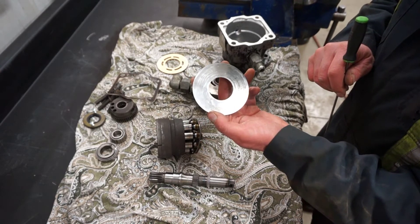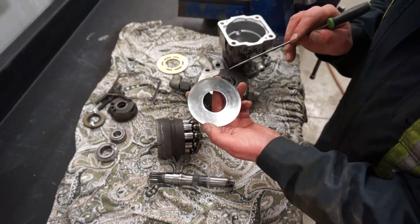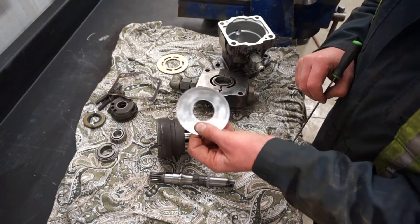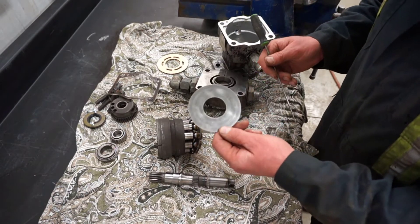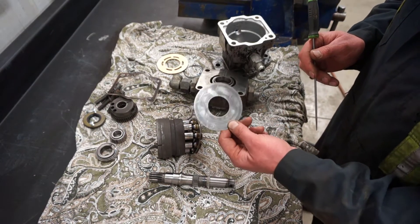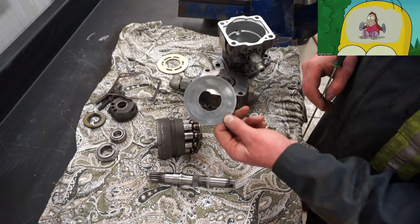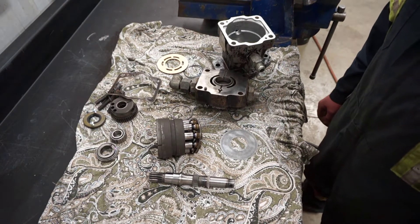If this was a critical service — high tractive effort, low speed, something that's heavy and needs a lot of torque — I'd be worried about leakage coming from underneath the slippers and would want to replace the plate. But this motor is a high-speed, fairly low-pressure motor. Some pressure is required to get the unit up to speed, but the leakage during that time is actually unimportant or even beneficial. This motor is driving the vibrator on a pad foot packer or roller.